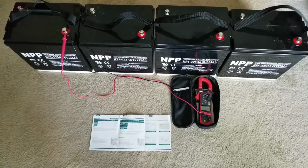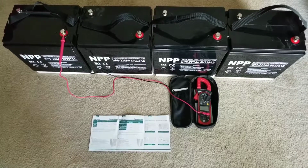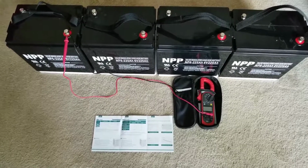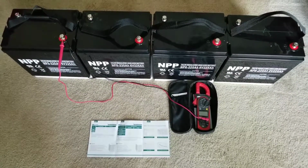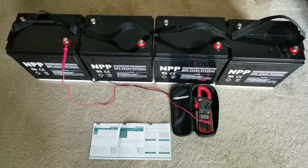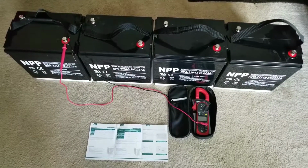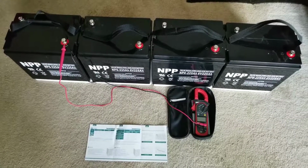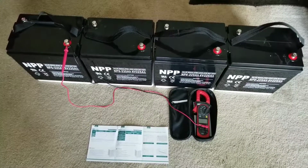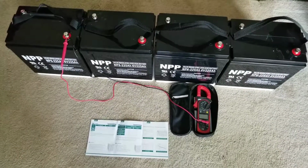And this is the way I'm gonna transition to a new set of batteries here, and gonna keep them all the same brand, same performance, same specifications. One charge controller, maybe the Classic or the Outback, gonna be charging each of these batteries. If I decide to go 24 volt on these batteries, just one more set of these, then it's gonna maybe be the Classic or the Outback gonna tie into this. Or if I get the other set for my 48 volts, that will be 8 more batteries. So I'm gonna have 16 batteries total.